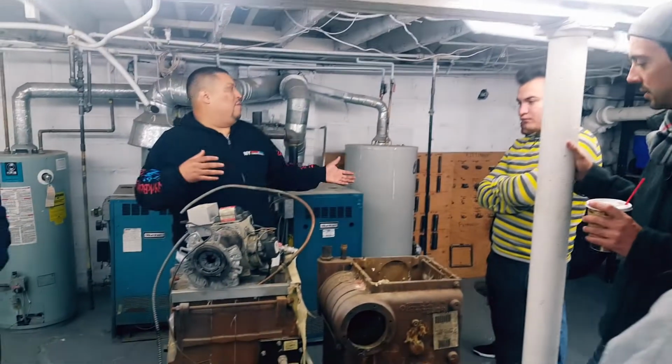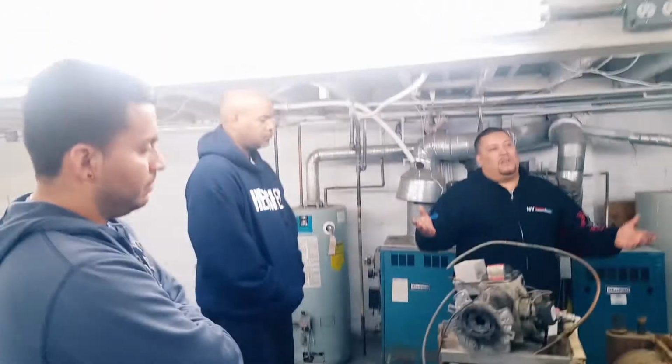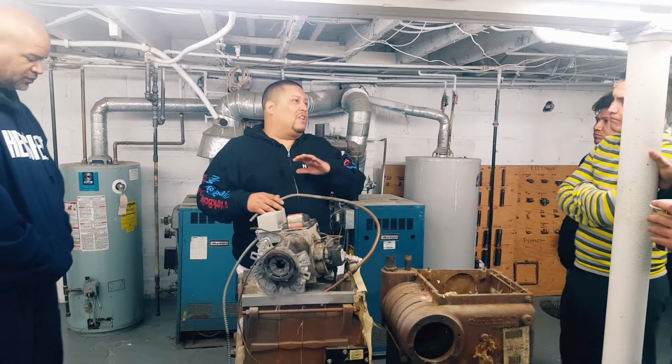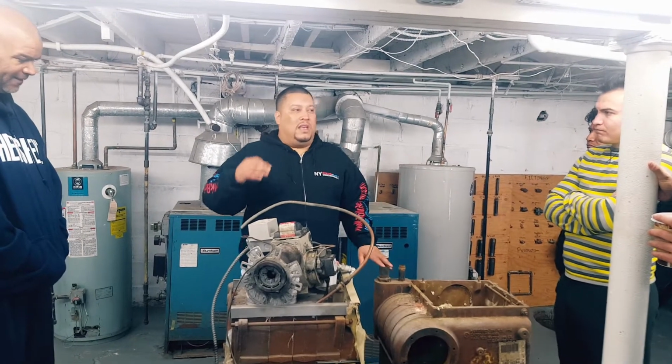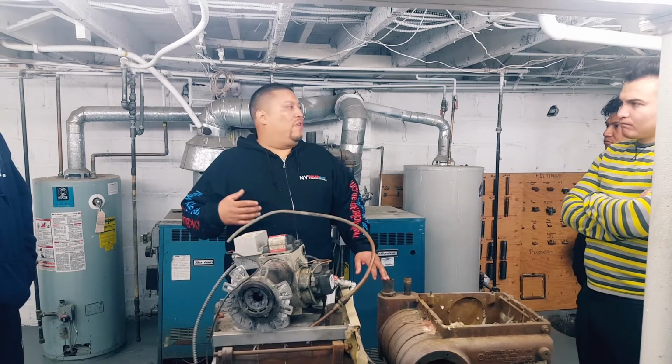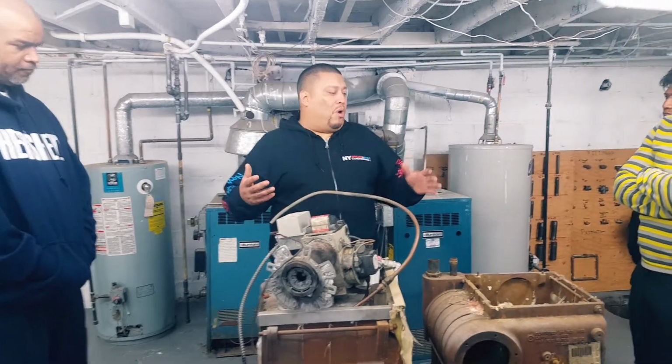Correct. Okay. You guys following what I'm trying to tell you? You understand? Yep. So that's what I'm trying to say. In that case, if it's a cold start boiler, that means there's nothing controlling the temperature. It only heats up on demand for heat, at a call. Exactly. Every time there's a call for heat, that's what it makes up. A warm start boiler has an Aquastat.